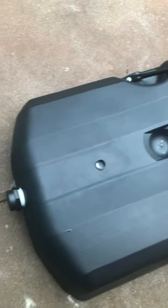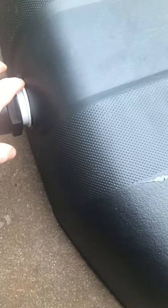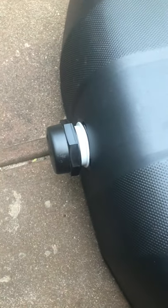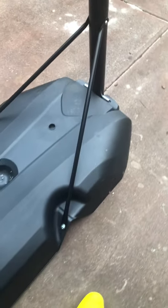Wet wash sand is very hard to get in. What I did was drill a hole in the back of the system. From my local Bunnings store, you can purchase two-part epoxy for plastic, a 50mm coupling, drill a 50mm hole, and fit a cap. I was able to fill the sand through there — probably two to three times quicker than any other way.